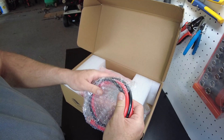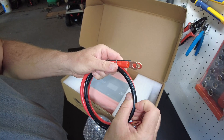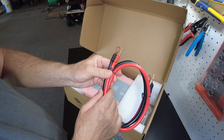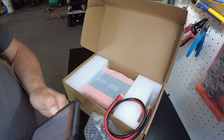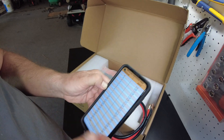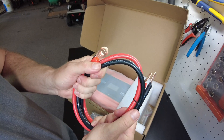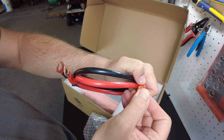It comes with some cables. It's got a 200°C rating on it. This feels like a silicone type wire, which is a nice upgrade from what I'm used to seeing inverters come with. It's 20 millimeter square, which according to the table looks like it gives us around a four gauge size. I'll test with these cables — I'd honestly probably want a larger gauge than four, but we'll see how well they do. It definitely looks to be a copper conductor.